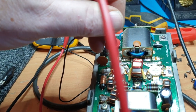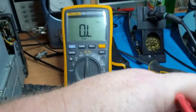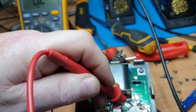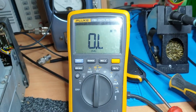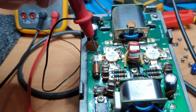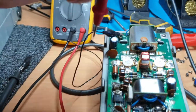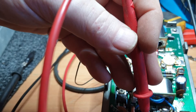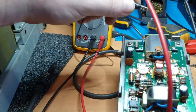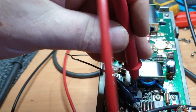Now I need to pull those out of circuit — so that's registering 25 ohms there. It's registering zero ohms there. We'll just go back onto this other one — for the moment, we sort of know we've got a problem there. If I just put this back over here — put them on that 485 on the emitter.